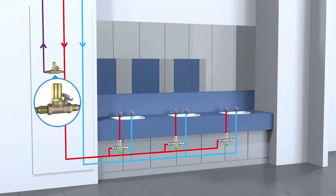It's suggested that the valve should always be positioned on the return line close to the point of use, so that the dead leg of uncirculated hot water is kept to a minimum.